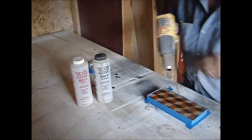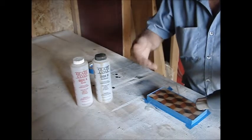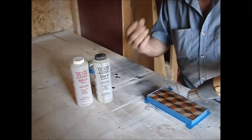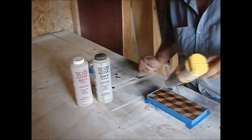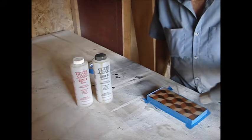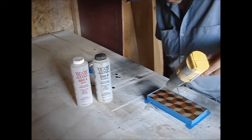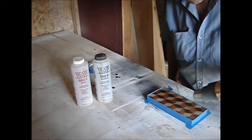Another thing — when you're doing a lot of different woods like this one here with little designs in it, air bubbles — you'd be surprised at how much air is actually in wood, especially porous grain wood like oak. It'll start pushing little air bubbles up, so when you put this down you may think after the first five minutes it looks perfect and you can walk away. But you can see it's now starting to come out real good — the heat brings those bubbles right up and they just start popping.